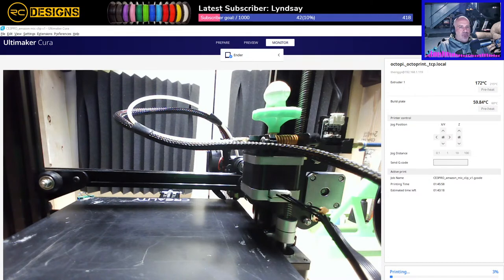So as that was doing the bed mesh leveling, it brings the nozzle up to 170, 160, 170, I'm not sure. And it heats that nozzle up to 170 while we're doing the test. So that kind of stabilizes at the 170. And then as soon as the bed mesh level is complete, it brings it up to the 215. And then we do two paint stripes, and then we're kind of off to the races.